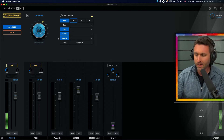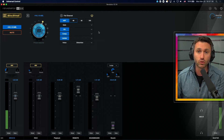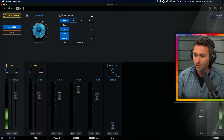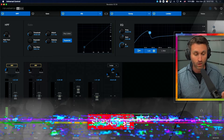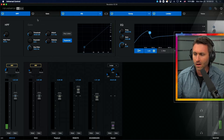I utilize the fat channel. Let's get into the mic processing first, and then I'll show you all of the mix minus capabilities of this interface, virtual devices, and how you can send different mix minuses back out to your remote audience. This is my chain for the 416 with the Revelator. I've got the high pass filter on at 40 Hz — I don't like to cut it too high with this mic; I try and keep it pretty natural sounding. I actually do not use the noise gate or expander, but I will experiment with it here.